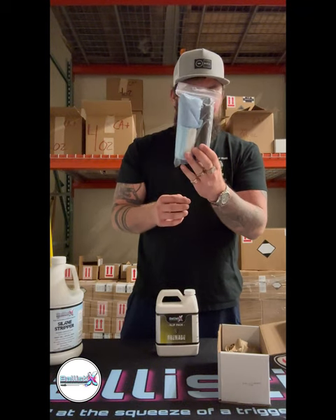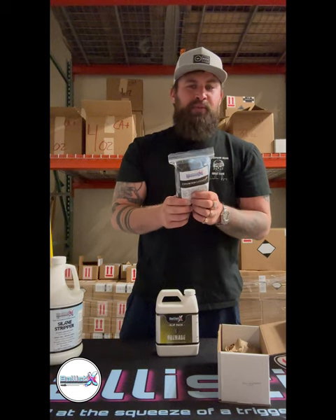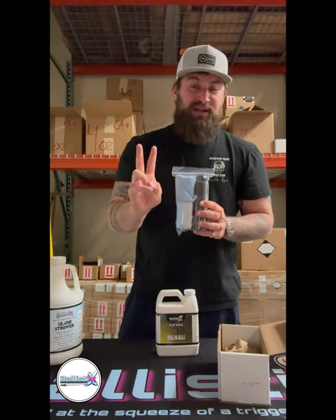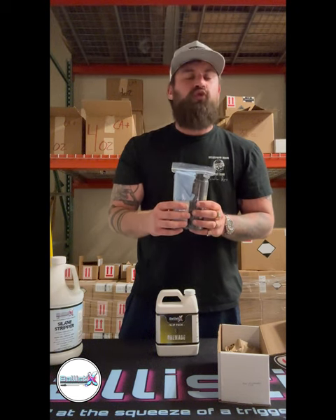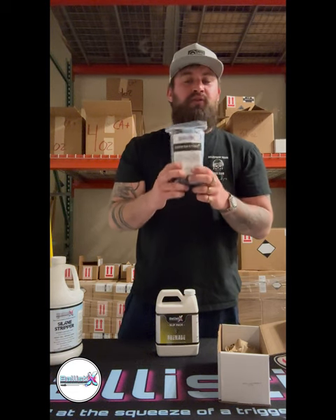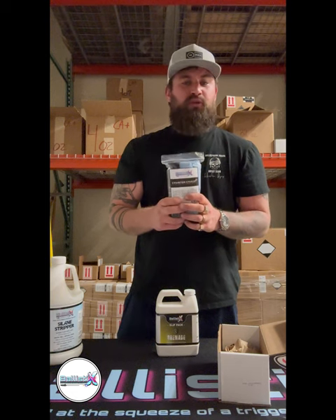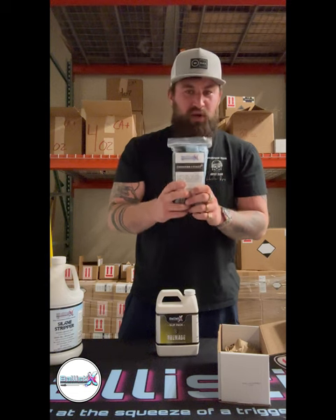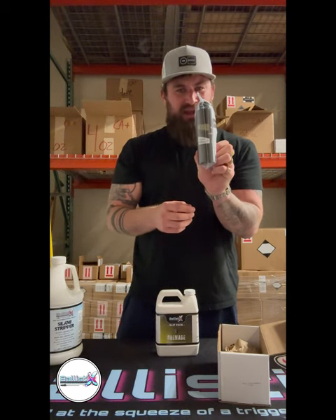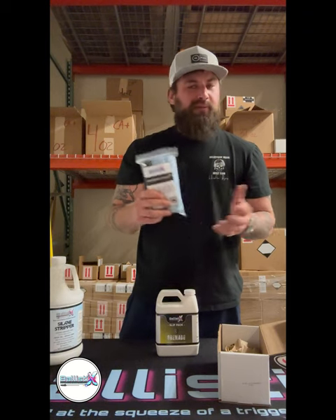I could do two kitchens with this little bottle. Even though the name is Counter-Attack Plus, this is not limited to just countertops. This is one of our quickest curing products — you put the product down, rub it in with your staining sponge, and give it about two minutes only. Anything after two minutes it gets extremely hard. Once you put it down with your staining sponge, use your towelette to simply hand-buff it off. This offers food-safe protection and can go on nearly any surface. For deep pour people and live-edge folks that like to work with wood, you can use this over most oils and directly on your artisan epoxy needs. This size will do about 100-plus square feet — a simple rub-on, buff-off. You can topcoat your epoxy with this in about two minutes and be done with it.